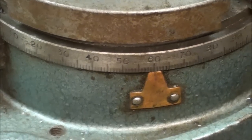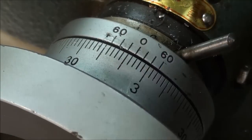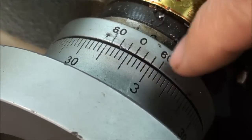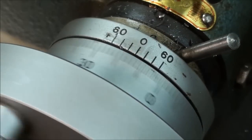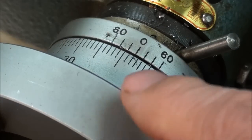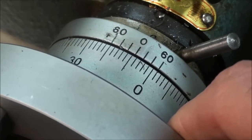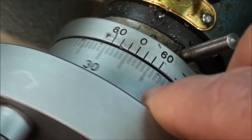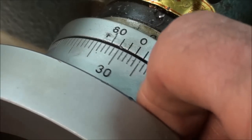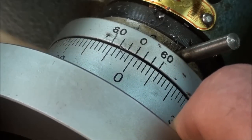Let's take a look at the crank and the zero marks. Pay no attention to the other marks — we're only interested in the zero at the tip of my fingernail, and I'm always turning in this direction. I must never pass the zero mark. If I do, just going back a little bit is not going to do any good because I have backlash. Should you overshoot the mark, be sure and back it up a turn or so, and then come back into the zero again. That removes the backlash or the lost motion — that's important.